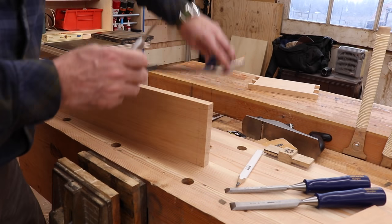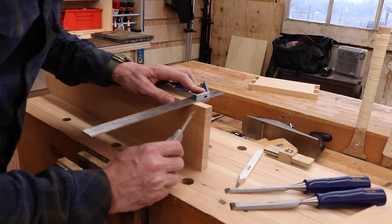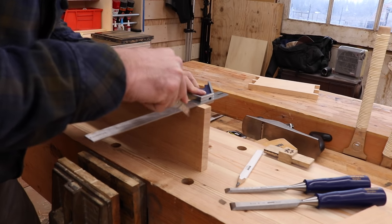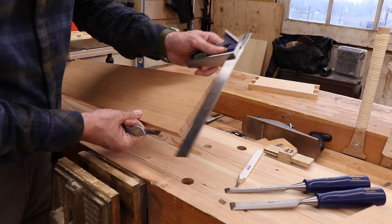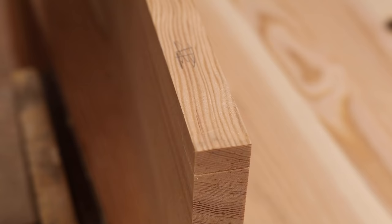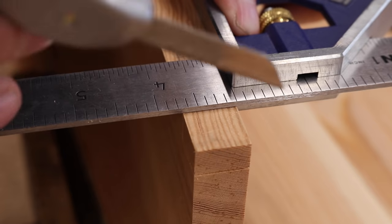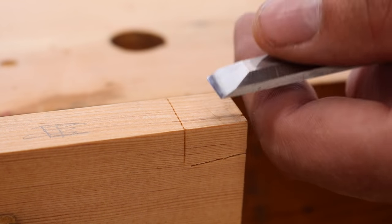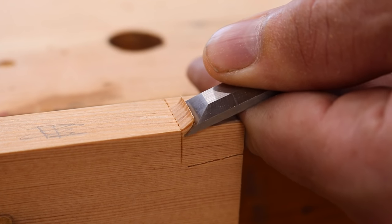Now we need to transfer those lines around to the other side — this is the important bit. What messed me up before is I didn't measure from the same spot, so I put a reference mark. We've already got the knife line established, so to transfer it around to the other side, put the knife into the knife well and slide the piece over until it touches. When I talk about reference, I mean: measure from the same side each time. If the board's not square, the lines will not come together. These two points now will come together at the same reference. Now we take our half-inch chisel and remove the waste on the outsides, cutting to the knife wall.